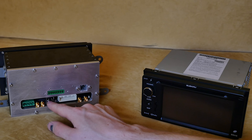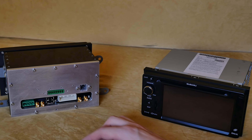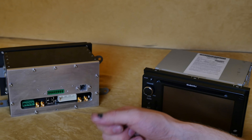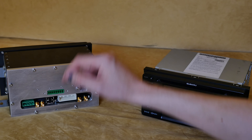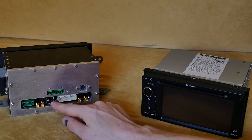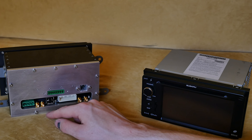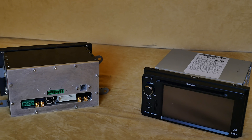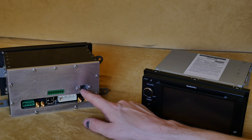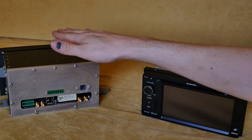These two connections will be connected to the cameras. Basically, if I put the car into reverse, one USB will be enabled, and if I press on the screen to enable the second camera, it will show the front view. So I can record video, and if I shift into reverse it will switch between front and back view. This is the stock connector for USB — the tablet supports USB.